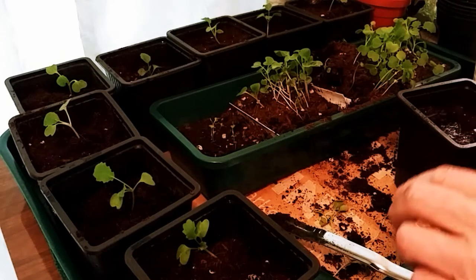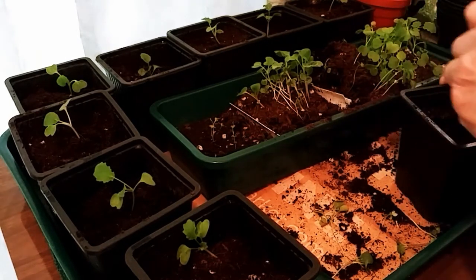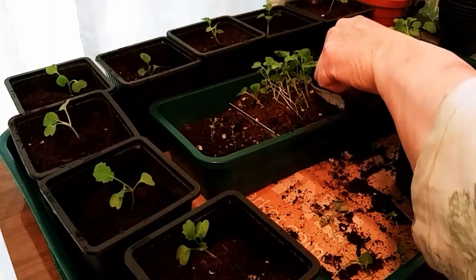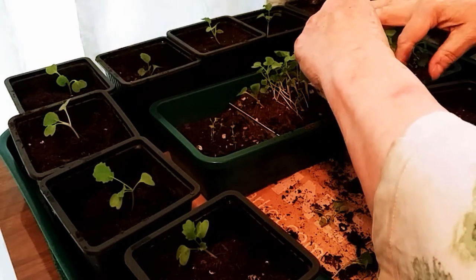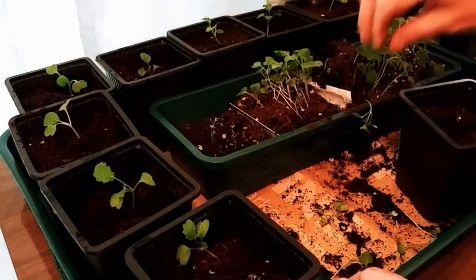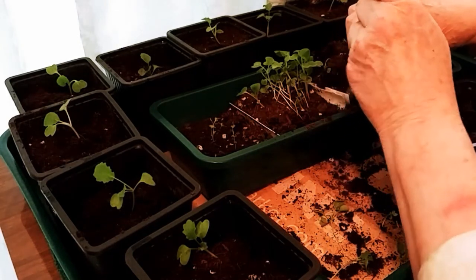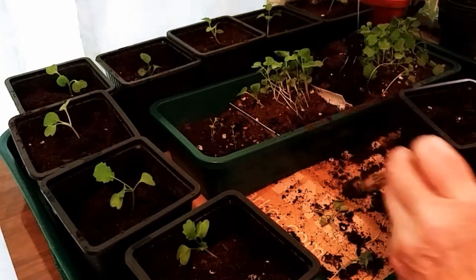I'm testing out this low-res format because I'm doing a voiceover, and I do enjoy that. Between my squeaky floor — your wooden floors squeak because the nails pop up from the plywood underneath your linoleum. When we renovated upstairs, we pulled all the carpet out — it must have come from the seventies. We put in not-expensive click-together hardwood flooring. We made sure all of the nails were completely hammered back into the plywood underlay so there was no squeaking.